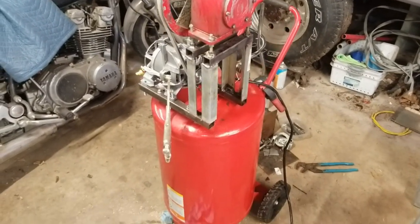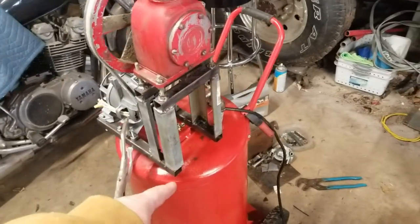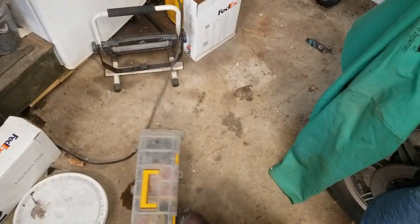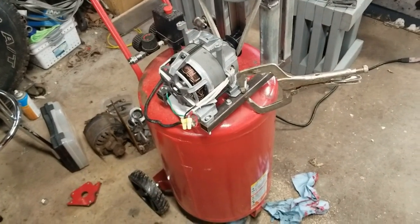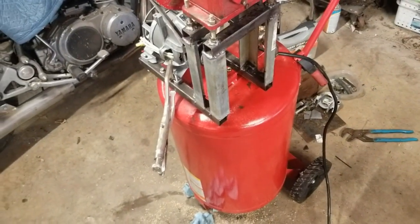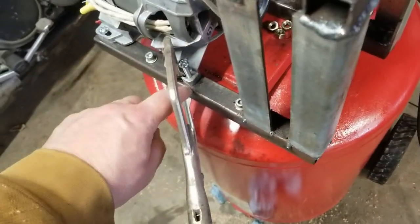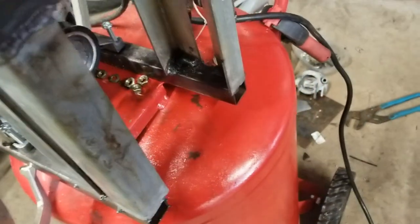The last thing that, oh, note to yourself and myself, brake clean and Ironton compressor paint do not work together, it takes the paint off, as you can see on my rag. So, what was I saying? Last thing I need to do is the two front screws need a hole drilled through the tube and the red base plate on each side.